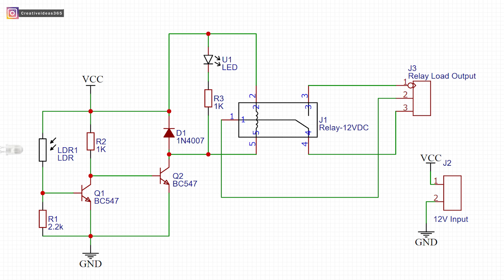In the opposite way, if the LDR gets light, then Q1 transistor becomes conductive. All current flows through the shortest path — from VCC to ground through the 1k resistor. No current will flow from Q2 transistor's base, so it will not trigger Q2 or the relay.